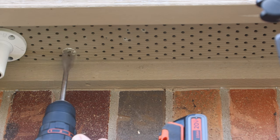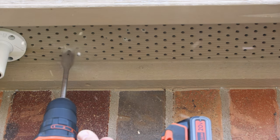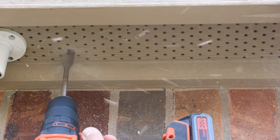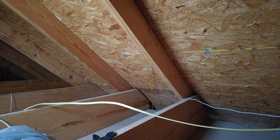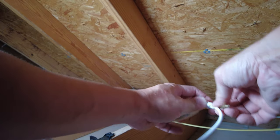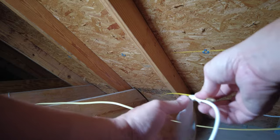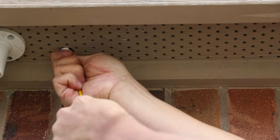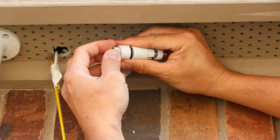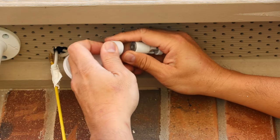First, let's drill a hole under the eaves. I needed the fiberglass rod because this part of the roof in the attic is too tight for me to crawl in, so I just push the rod in — the longer the better. Up in the attic, you should be able to see where the rod is, and I'll tape the power cable to the rod with electrical tape. Then back outside, I'll just pull the rod out and hopefully the cable comes with it.